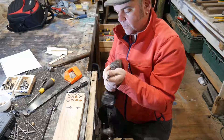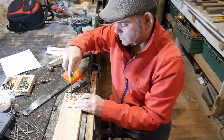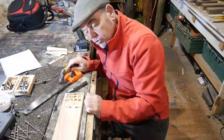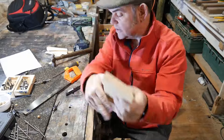If I just drill that in here — doesn't drill too badly — and you grab one of these plugs, let's grab one of the right colour, and tap it in. It's a lot looser than the other one. The reason is the bit wobbles. The first method is very, very neat. The second one isn't quite so good around the edges — you can see there's a gap around it and it's not a snug fit, because when you try to drill with that bit it wobbles.